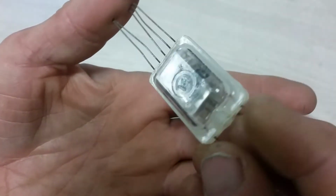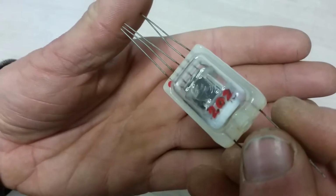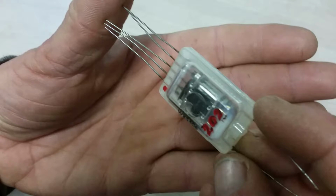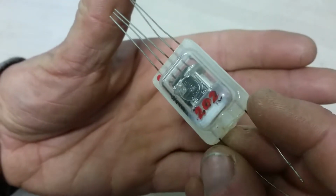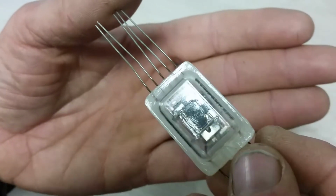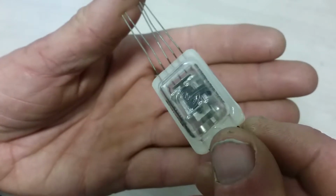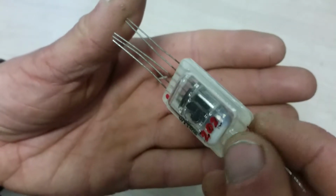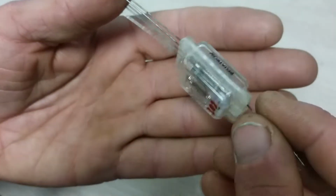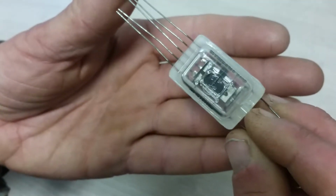And stick the tube in. And the tube, by the way, is, I understand, more or less a 6AG5. There is actually a data sheet on the web for these. It's a preliminary data sheet, but it's a data sheet nonetheless. 6AG5, of course, is a very common tube of the late 40s and early 50s. And, oh, cripes, they were very common in early television sets, early post-war television sets. So, yeah, 6AG5. You essentially build a 6AG5. Of course, you got to lead it out a little differently.